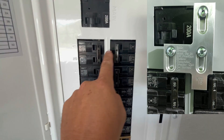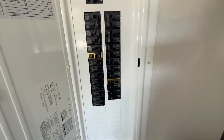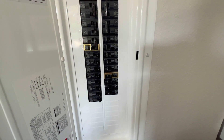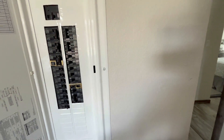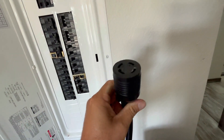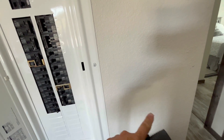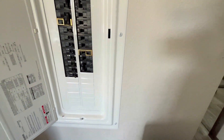With the grid off and that port on, you plug it in and your whole panel would be powered up at 240 volts with 6,000 watts available. My configuration here would be 12 kilowatt hours. So it's that simple. If you're going to use the Reliance critical loads panel, you plug this same plug right into its receptacle, and all those circuits you have on that panel would hot up as long as you put it into gen mode. It's that simple.